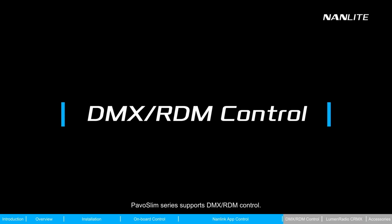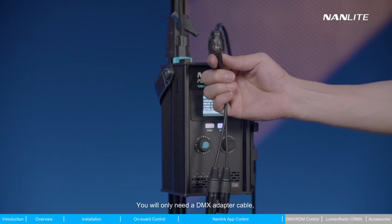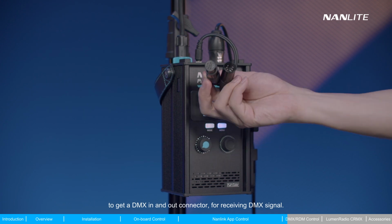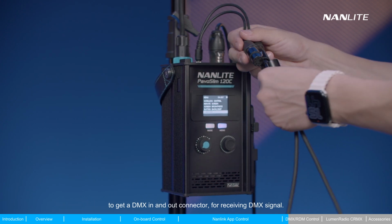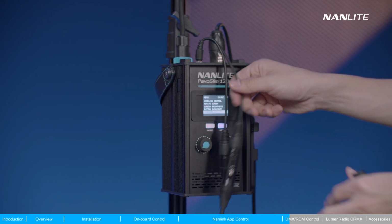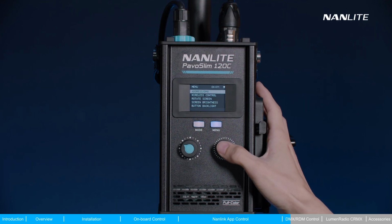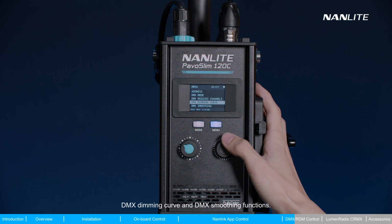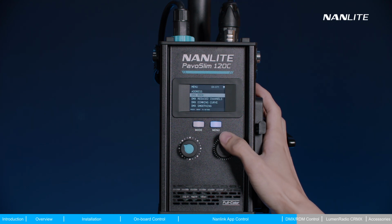PavoSlim series supports DMX RDM control. You will only need a DMX adapter cable to get a DMX in and out connector for receiving DMX signal. There are DMX mode, DMX reduced channels, DMX dimming curve, and DMX smoothing functions. Let's set them one by one.